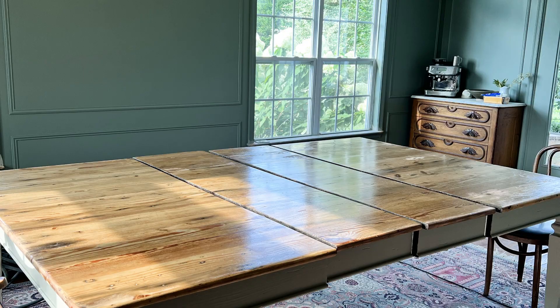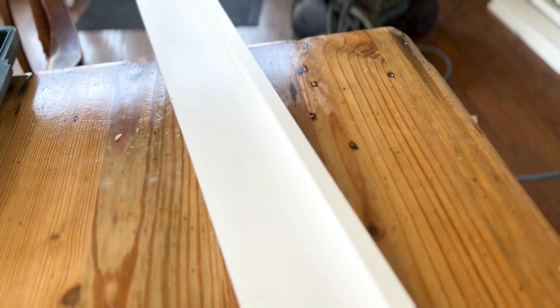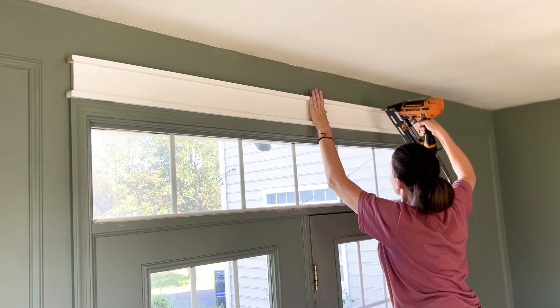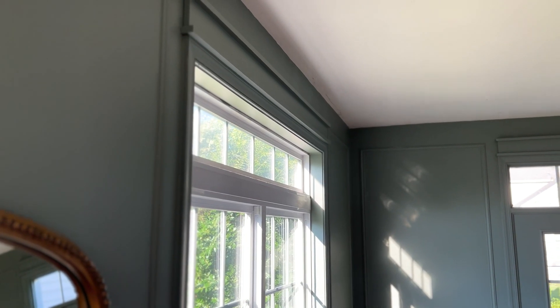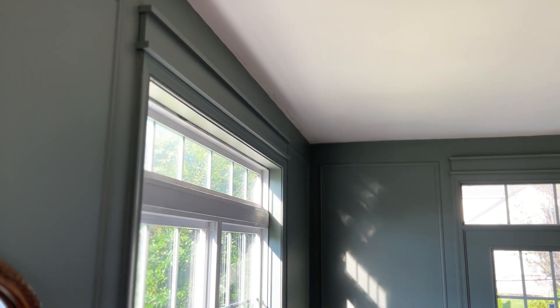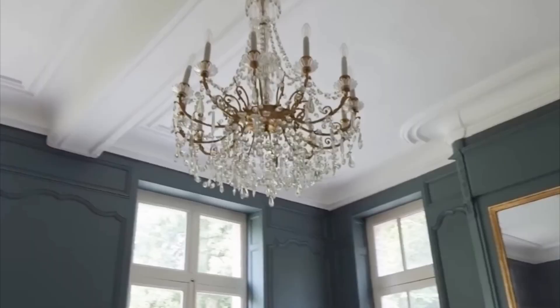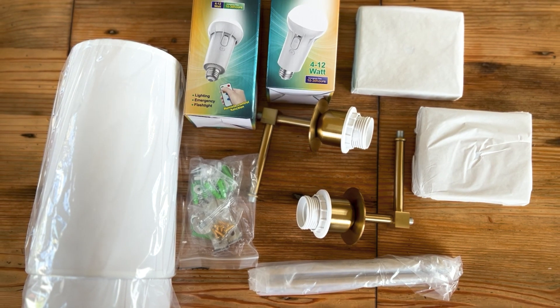As the table dried, I worked on some additional trim for the tops of the windows and doors. This is a really simple way to add depth and character to your current molding without tearing anything out — it's two one-by-twos and a one-by-four assembled first, then attached to the wall. It adds some nice height to the room and a little more drama. Eventually I'd also like to add crown molding around the top of the room — it helps blend that pop of color into the white and looks very English — but for now I'm going to focus on adding cozier elements and save that for phase two.